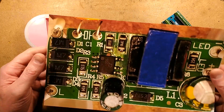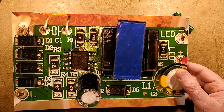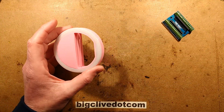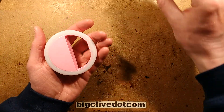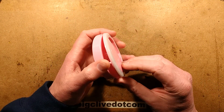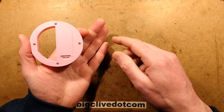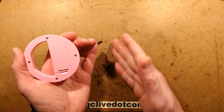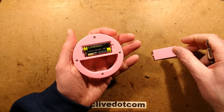The quality of pictures this can produce in the right circumstances are pretty good. This was taken with that little ring light on this exact camera, and you can see it's illuminated from all sides - that was done with the main light out, so this was the main source of light. This was recommended to me a while back. It turns out they're okay, but they do create sometimes, if the circuit board's shiny, a circle of lights or quite a sharp arc across it, so you have to be careful how you use them.